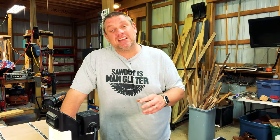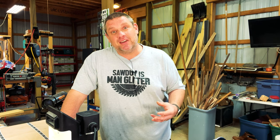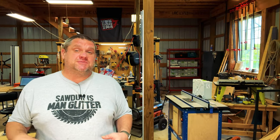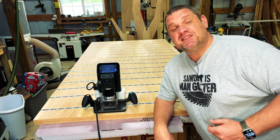Now that the Shaper knows the height of the router bit relative to the top of the plywood, we can begin making our cuts. Before we make our cuts, we need to make sure that we attach the dust collection system, or this thing will clog up. We also need to think about the depth of cut — in this example, we're going to go a quarter of an inch deep. Anything beyond that seems to be a little too aggressive for this machine. When I created my first two trees, I was going up to three quarters of an inch, and this was really bogging down the machine. We're just going to make a quarter-inch pass on this entire tree, then use that as a template with a flush trim bit.